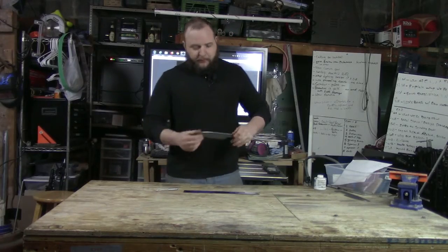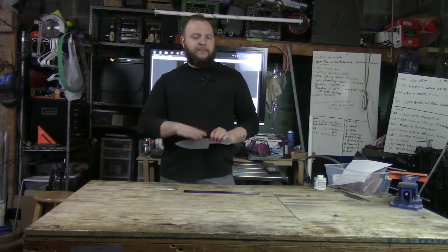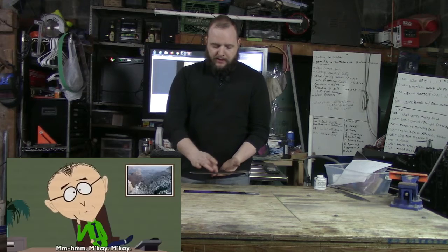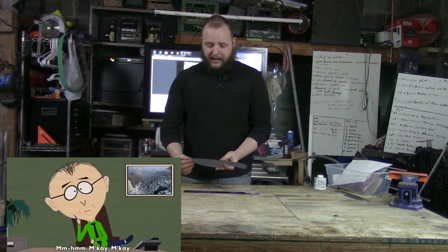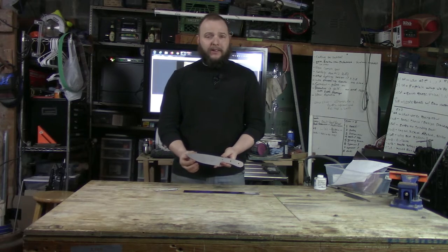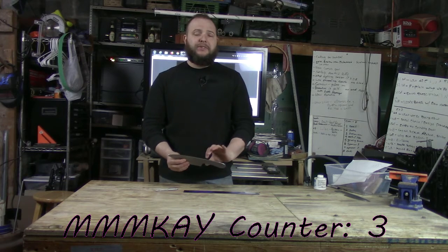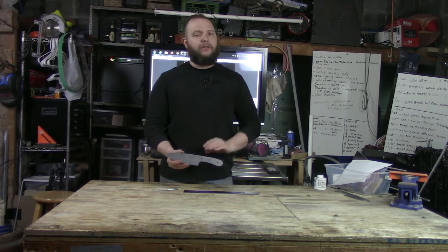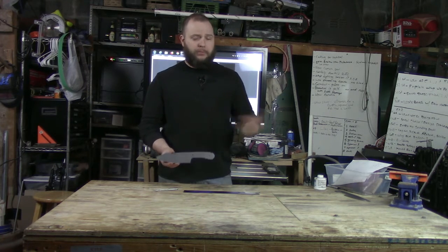Back to the workbench. Thank you very much, Chaco. So, we have our template. We're going to talk about this very briefly and some of the reasons why the template is the way it is. The template features a very nice 8-inch blade. It's a chef's knife. We carry the belly a little bit forward for a nice rocking motion. The handle is intentionally left thick at this point, specifically because we tailor it to the user's hand. This is a question that I do ask in the process.